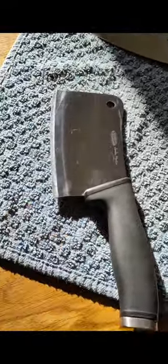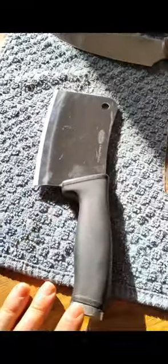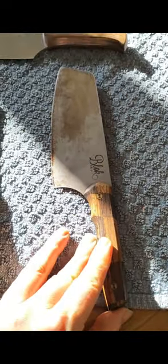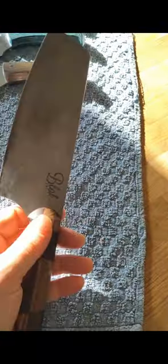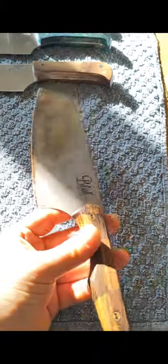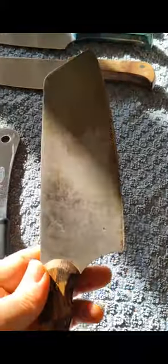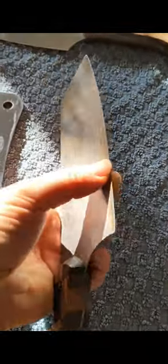Okay, so this is a really cheap knife in comparison to a handmade knife, so it shouldn't really be compared. But right here I've got a block knife vegetable cleaver, which is tool steel. I want tool steel. It's one of the knives that inspired me to start making knives. As you can see, the spine there is about 2 mil, I think, maybe slightly over. And I haven't actually sharpened this in ages, but the secondary bevel is a micro bevel because the blade's so thin behind the edge.